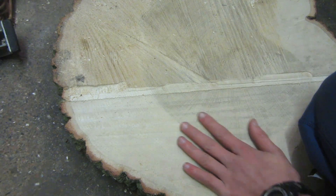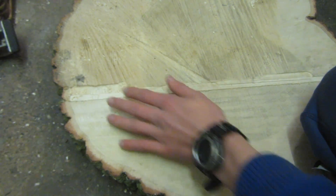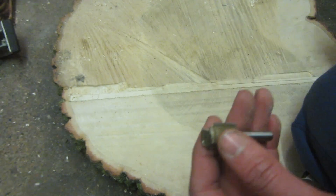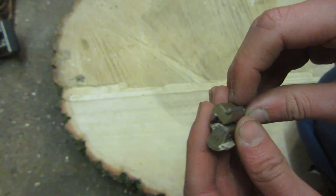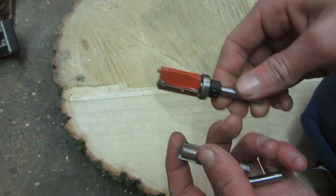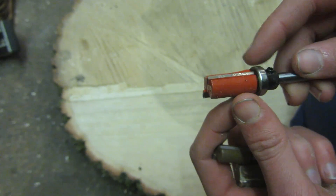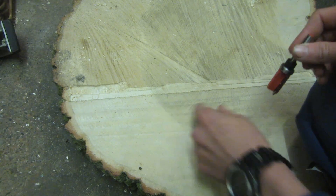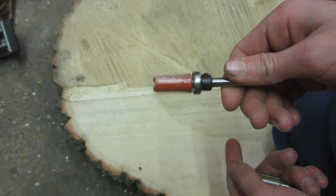Things were going really well until I got to one section where the bit went a little crazy — I was going too fast — and I actually sheared off both tips of the bit. My only other option was a much smaller half-inch bit, which would have taken double the time. So I went and bought a new longer bit from Amazon. Because this is end grain, it's much tougher on bits than I realized, so I'm going much more slowly — I don't want to break this one since it was five pounds.